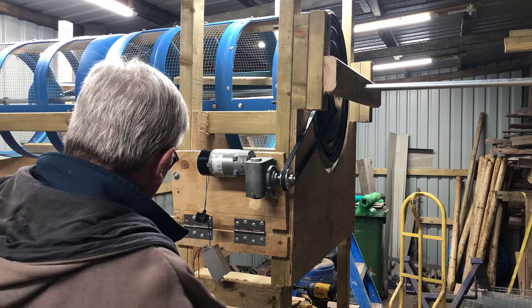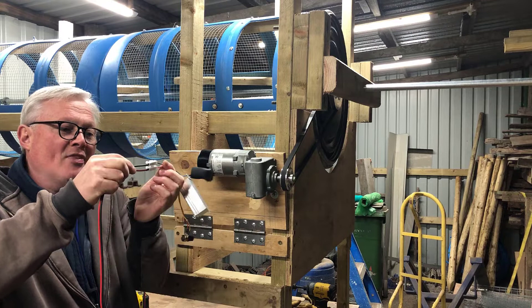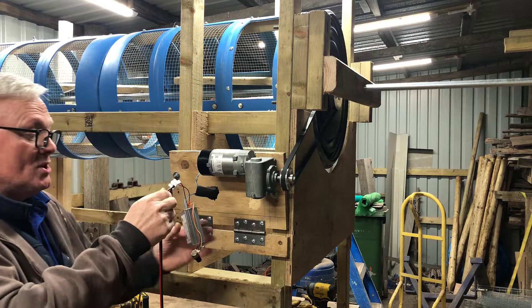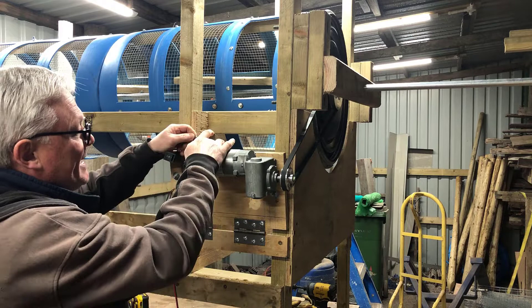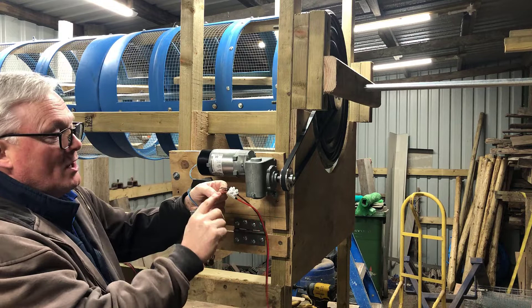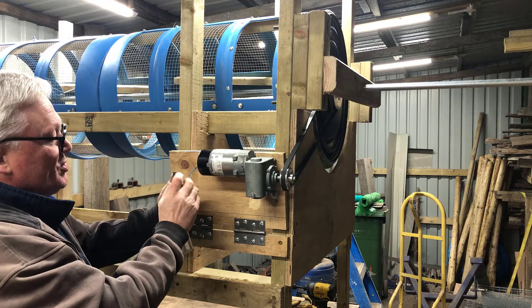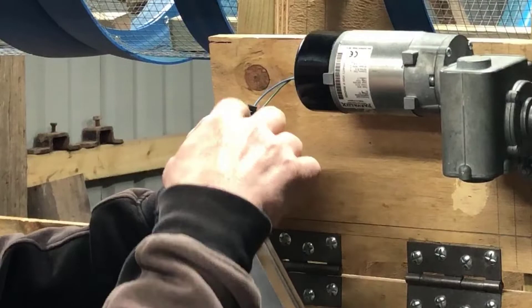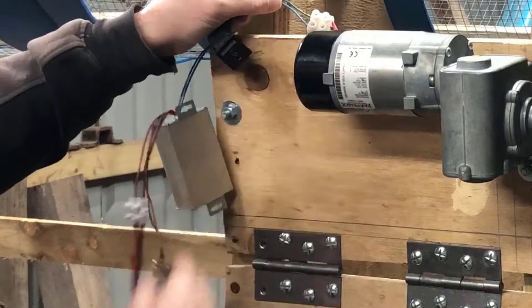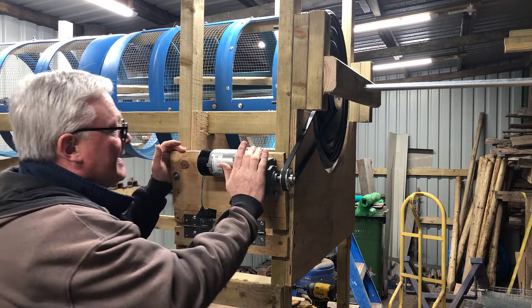At the moment I've got it connected to a big leisure battery - just out of shot. Your 12 volts come in to the live and neutral on the controller. It does matter which way around you go on the motor - if you put live and neutral one way it'll spin one way; swap the wires and it rotates the opposite direction. So the red is live, black is neutral. You put live and neutral from your 12-volt battery in, it goes through a rocker switch - off in the middle, position one and two so it can turn both ways - then two cables come out, blue and green, which go to the motor.